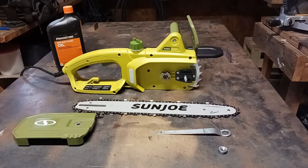It has a safety switch to prevent accidental starts, and it cuts up to 13.5 inches in diameter. Keep in mind that this is a 14 inch blade. One of the questions somebody asked was: can I run the saw off of a car battery with a 500 watt inverter? The answer is no. Amps multiplied by volts equals watts — 9 amps times 120 volts equals 1080 watts. So that's the answer to that question.